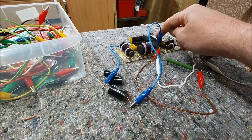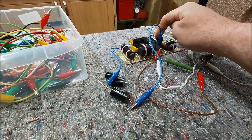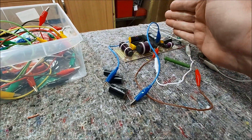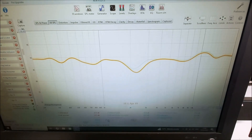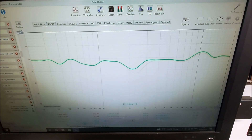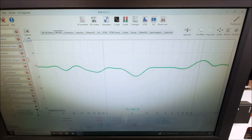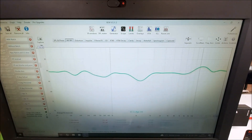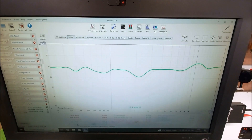Now I've been playing with the second capacitor value on the tweeter circuit. It uses a third-order circuit with this notch filter - originally 4.7. Adding capacitance pushes the crossover point slightly lower, allowing the tweeter to play slightly lower, which helps lift out that dip a little bit. The green line is with an additional 2.2 microfarad across it - much better. We still have that dip but it's not as deep. Having done some off-axis measurements, I'm sure it was there as a compromise, as not much changes as you move off axis.